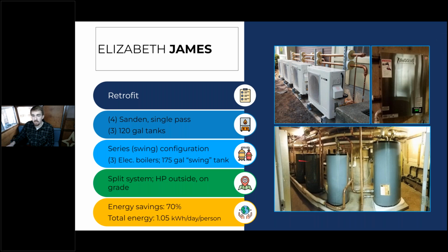So really the only time these auxiliary electric water heaters are used is when there's almost no usage from the building. So there's none of this hot domestic hot water that needs to be served out to the system and heat this tank. So if this water is sitting there waiting to be used and that temperature maintenance line's continuously circulating and cooling this tank down, that's when this electric water heater will kick on in the background. So that's how we maintain really efficient operation with these CO2 heat pumps that like really cold water while still not using too much electric heat.